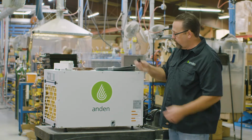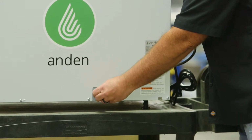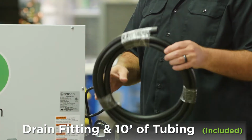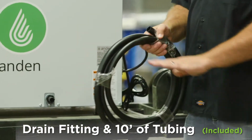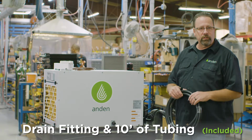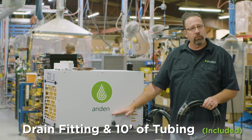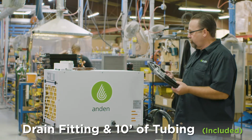So this unit comes with a fitting that'll screw into here. Use some thread tape on that to get a good seal. And then we send 10 feet of 3/4 inch drain tubing. So you would connect the drain tubing to that and have a good downward pitch towards the drain. No high spots. We want to get the water out of there as much as possible. You definitely don't want to run it up higher than the drain pan or the unit would back up inside of it. So plug on here and a good drain away.